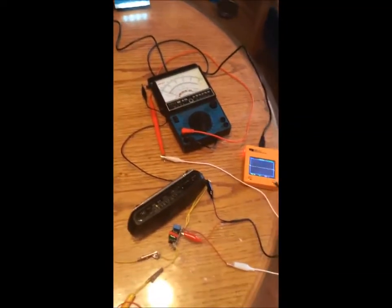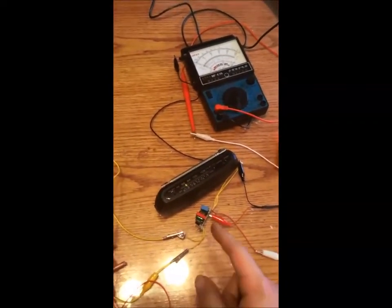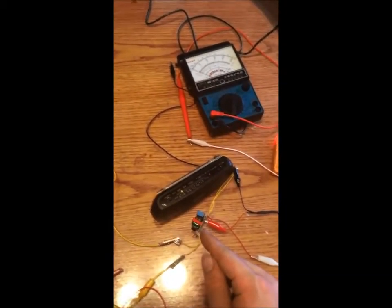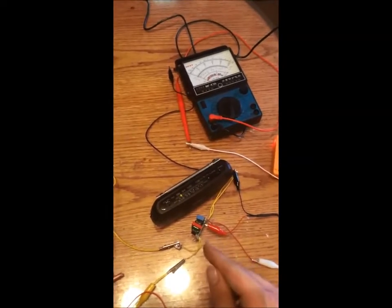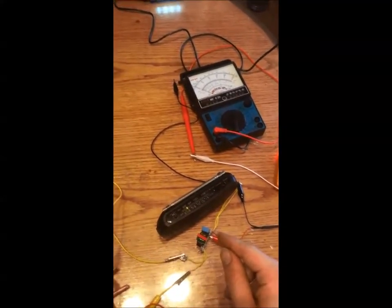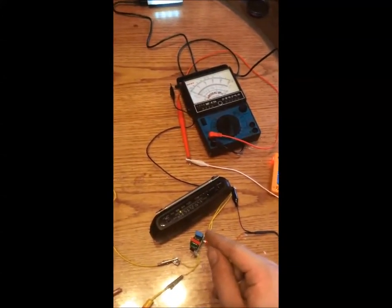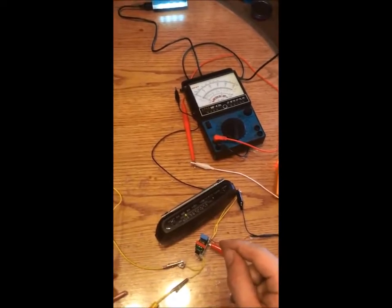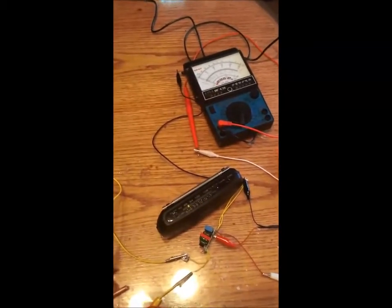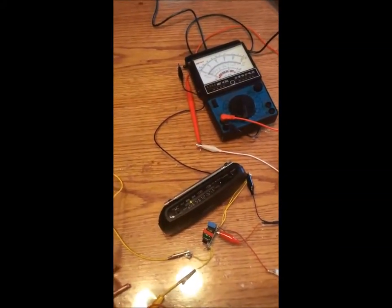to zap the flies. Well, I took the module apart here, and there was some junk I didn't need in here. So there was the LED for the power, which was consuming power, so I ripped that out. And there was also a rectifier, which I didn't need because I want the AC part for this experiment. I took the diode out, and there was also a loading resistor, which I took out because it was causing a bit of a drain.